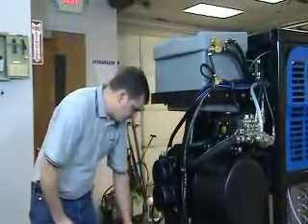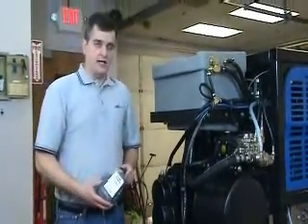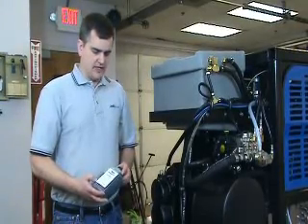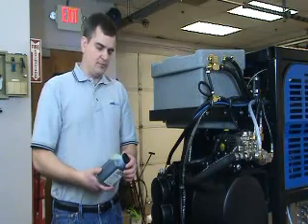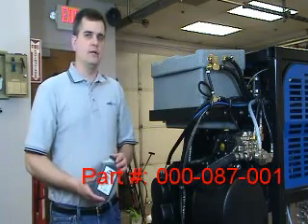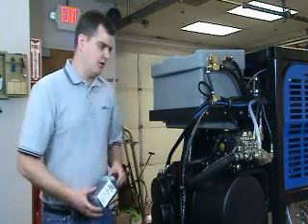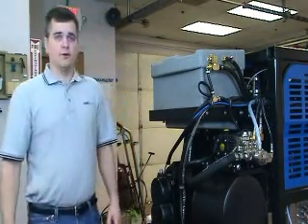For materials required, HydroMaster recommends an ISO 68 pump lubricant — in this case it's CAT pump lubricant — and the HydroMaster part number is 000-087-001. This is the only approved lubricant for use in HydroMaster high pressure pumps to maintain warranty, which will provide a good service life for the pump.